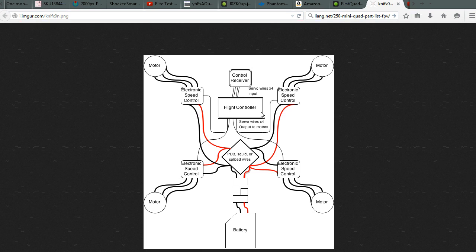The other component listed is a control receiver — the wireless component that receives your input and passes it to the flight controller, which then adjusts the speed controllers as needed. Flight controllers also typically have gyroscopic sensors to detect tilt angle and accelerometers to know how quickly it's traveling in a direction, using those sensors to compensate. There are other advanced sensors, but we won't go into those.